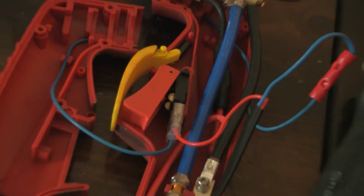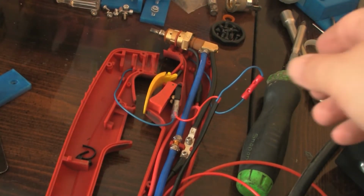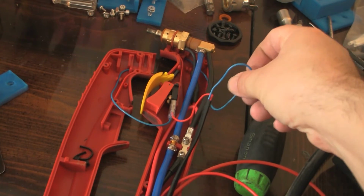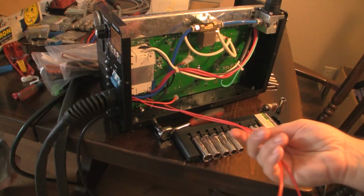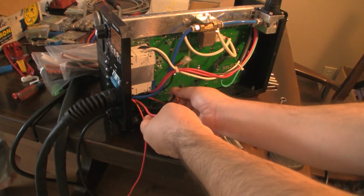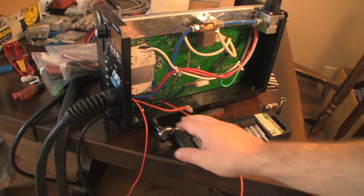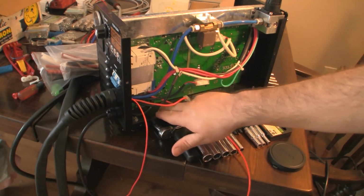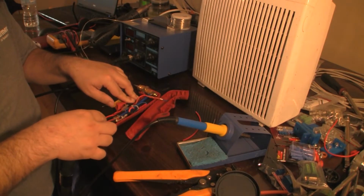The red wire runs from the switch to the machine, and I can tap that red wire inside the machine. So there was not a need today to run two wires. So now when these wires are connected to the relay and the computer sends the command to fire the torch, it will only fire if all the other safety mechanisms like the cap are in place, just as they would if you were closing the torch switch on the handle.